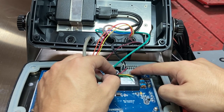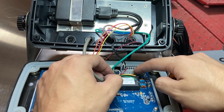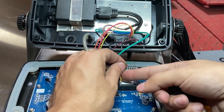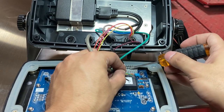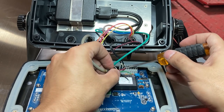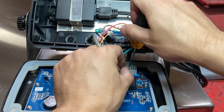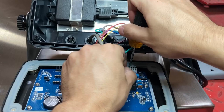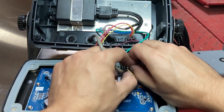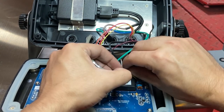The next one says SE+. This is a four-wire bench scale load cell, so you skip it. Then you go to the S+, which is the green cable. So skip one, and then connect the green to S+. You can see that I can't pull out the green cable or the red cable.